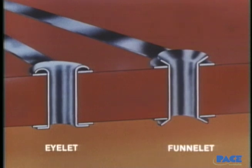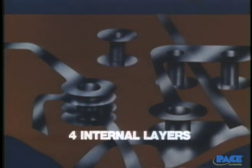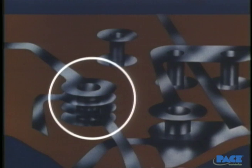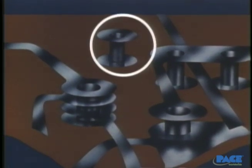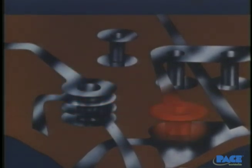The need to get more and more circuitry in a smaller space has led to the development of multi-layer boards. They're similar to double-sided boards, but have one or more additional layers of circuitry sandwiched inside. In some locations, the plated through holes connect to these internal layers; at other locations, they do not. This is a vital thing to know when you're removing a lead from one of these holes. The internal planes can act as a heat sink, soaking up so much heat that the joint never melts all the way through. Excessive heat, on the other hand, can damage an internal plane or cause discontinuity, often with no outward sign of damage.